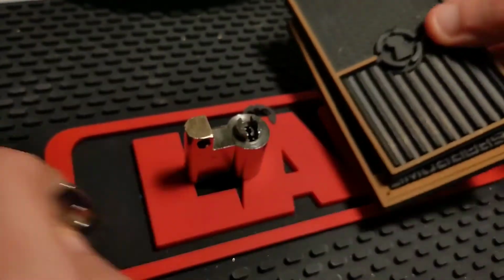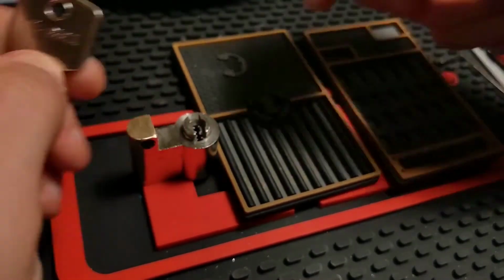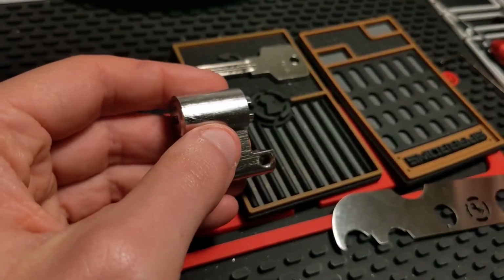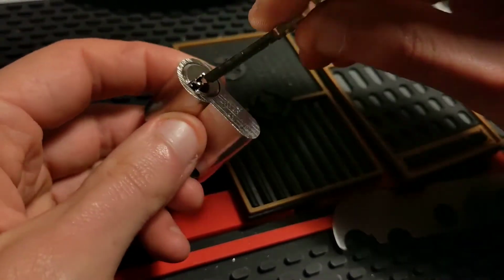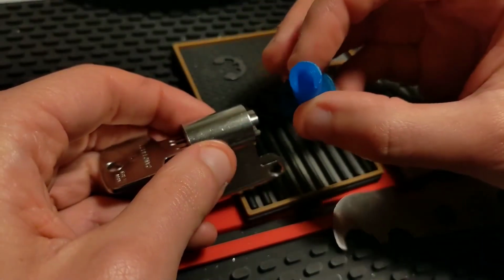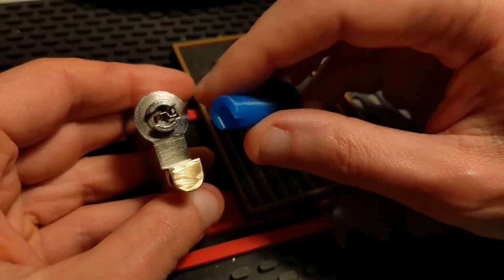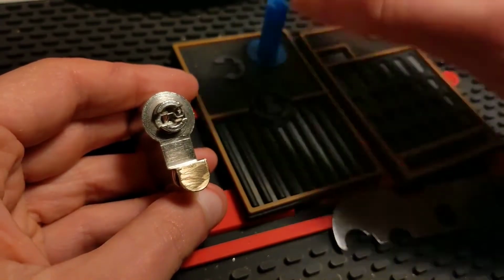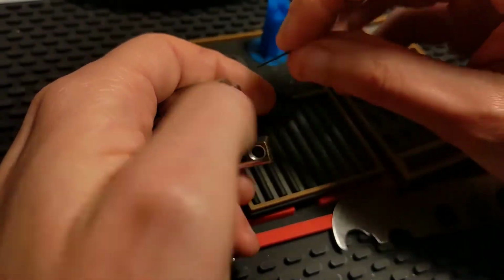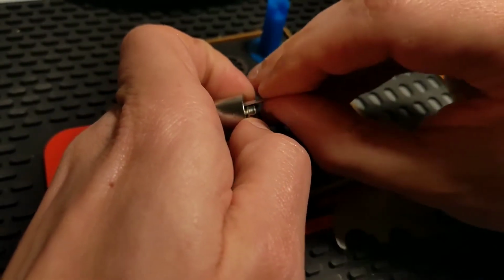Let me get these guys here. So I have the clip, the key, and so for the occasion I actually built a custom follower. The cylinder here, because the walls are so thick, is actually 0.4 inch diameter. Normal Euro cylinders are 0.5 inches. And so I will put a shim at the top.